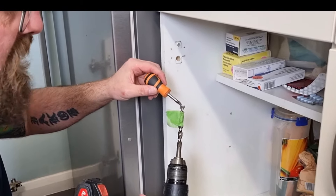Take your 10mm dowel, put some super glue on it, and place it in the hole. Remove any excess super glue with a little bit of tissue. Take your small hand saw and carefully remove the dowel flush. For the remainder of the dowel — because I'm a tight Yorkshireman — I'm not going to put a second dowel in, I'm going to use the same one. Place it into the next hole, just rotate to get good glue coverage, tap it all the way in, and remove the excess by cutting it flush. Simple as that — nice solid fixing.